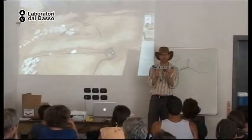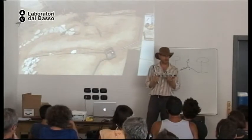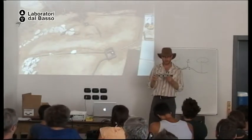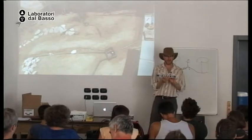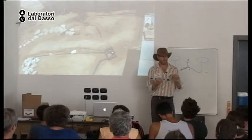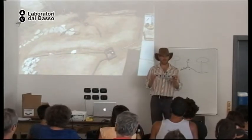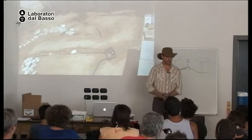This is my favorite tool to measure the slope of the pipe. It's not in metric, it's in US English units. But you can probably find one in metric. So in English units, I want a quarter inch per foot slope. And this lists 1/8 of an inch, 1/4 inch, 3/8, 1/2 inch. So I can be exact. It's really good. So I'll pass these around if you want to see.